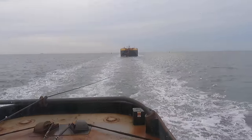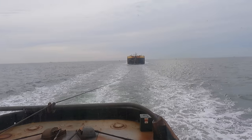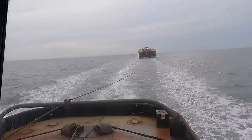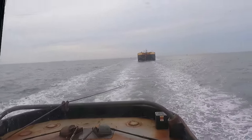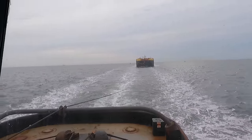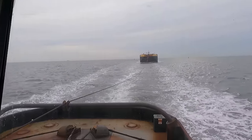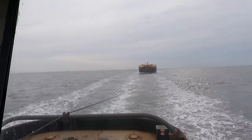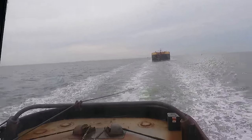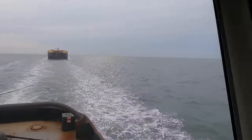Coming in nice and slow. Here it comes. Oh, that's beautiful. All right, I think that's about as good as we're going to get. So I'm going to wait until it comes up again and I'll stop. And I go all stop. When I go all stop, you can see the wire starts to fall. So even that little bit is just enough to have it advance on. Put the interlock brake on and leave the winch on so I can come running back and suck in some more and get further.